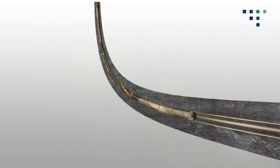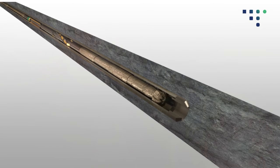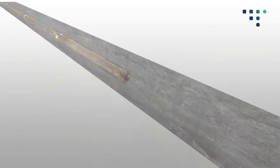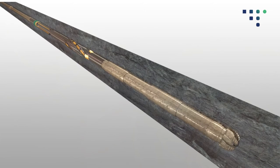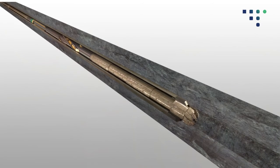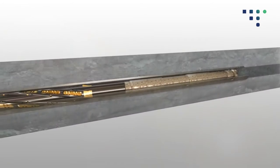Pick up the drilling BHA including the driller tools and run in hole as per the program. The driller Dillo offers flexibility to either TD, stop short, or continue drilling, as the driller Dillo will always be able to scrape the packer setting depths. Once the drilling operations are complete, pull the BHA back inside the casing to position the driller Dillo at the desired scraping depth.